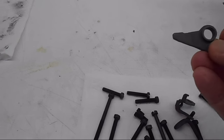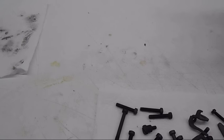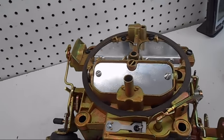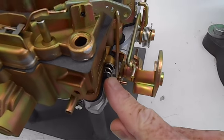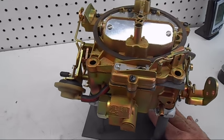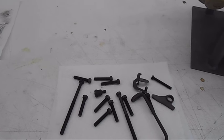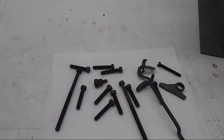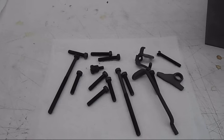These stamp steel parts come out a little bit lighter than the screws — I think it has something to do with the material. Notice how really nice and black the screws came out. Here's a carburetor I finished; you can see all the screws and fasteners are manganese phosphate coated. Also, you'll get carburetors that have cast iron base plates — Rochester 2-Jets, 4Gs, some Carter WCFBs — those are all done with manganese phosphate coating to protect them from rust.